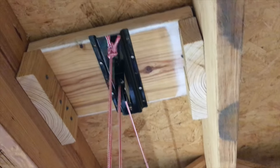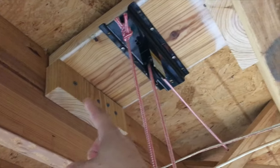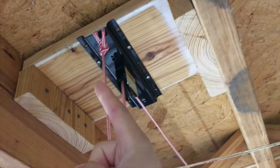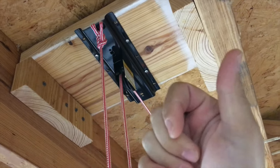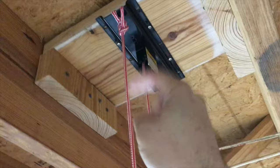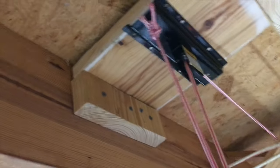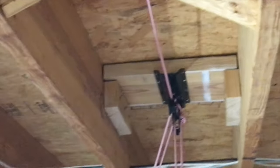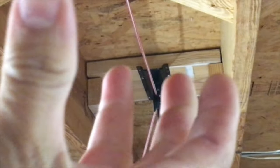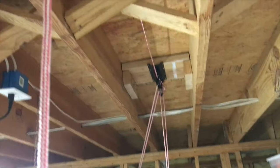Let me show you what I did up top here. We're up here in the rafters of the floor, in the garage. This is a 2x8 that I cut. I screwed the top long piece to these pieces before putting it up there, and I also screwed the pulley into that big 2x8. Then I put it up here and screwed on both sides into the floor rafters to hold it in. Same thing with the other side — same exact idea: screwed the long piece into these pieces, placed it all up there, then screwed into the floor rafters.